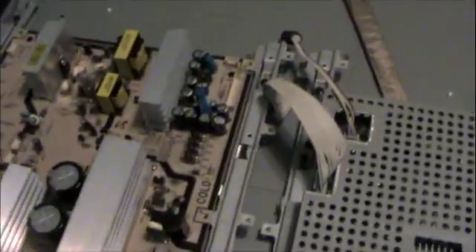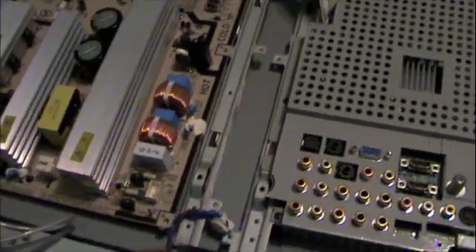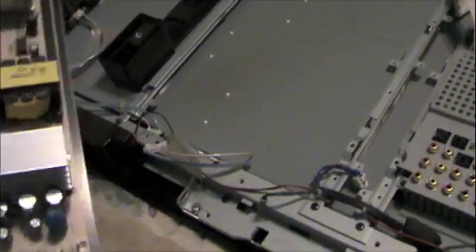We've disconnected each of the connectors from the perimeter of the board and removed six mounting screws from the outside. It should be safe to just lift it out. Even though the two large heat sinks are in the middle of the hot area, it should be safe to grab the heat sink and lift the board out — the heat sinks are just grounding the thermal pads. Just make sure you don't touch any other wired parts. We'll go to the rework area and use the soldering iron to remove each of the five 10-volt rated 1,000 microfarad capacitors and swap them out.